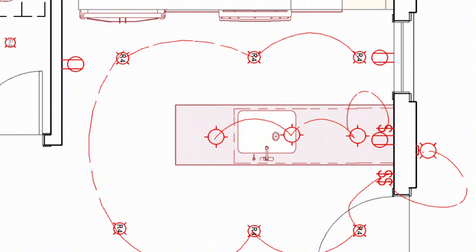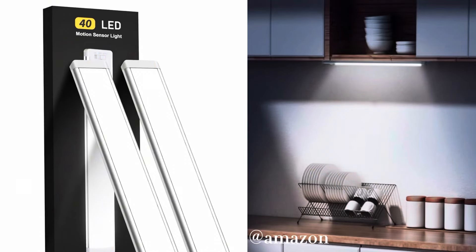As they're intersecting and servicing different areas, make sure the cans stay on a grid pattern, or that any change in the pattern makes sense. If you don't have under-cabinet lighting, move those can lights a little closer to the cabinets to compensate — or buy those rechargeable light bars on Amazon. We'll link them below.